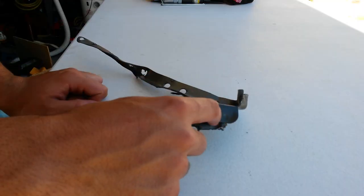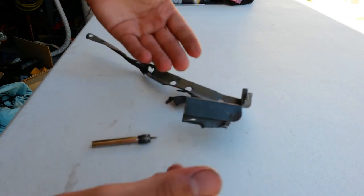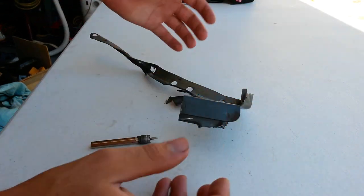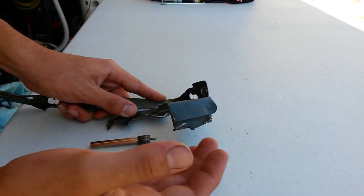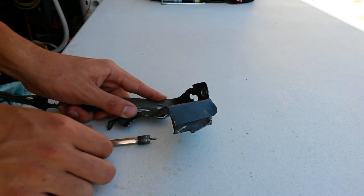Okay, so spot welds. These are spot welds right here. These are factory welds that are done to connect multiple pieces of metal together on the car, because most unibody cars are essentially just pieces of sheet metal that are just formed in different ways and then welded together like that from the factory. So in order to set free that front end or any other piece of metal that's attached to the car, you need to go ahead and cut out these spot welds.